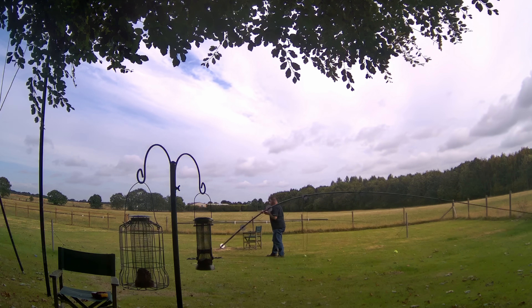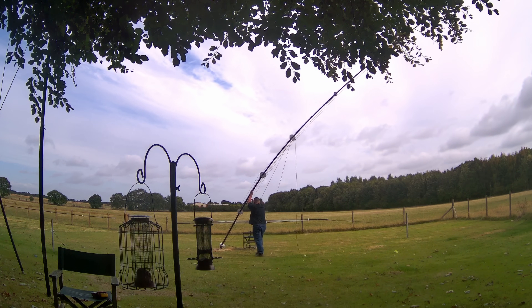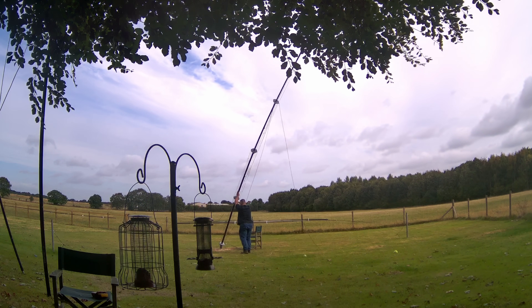I put the multimeter between the cabinet and the ground rod and all is working. What we haven't got is conductivity between the two cabinets. I believe I should connect the two cabinets together, although there's nothing actually touching the other cabinet right now, so it doesn't matter at the moment.